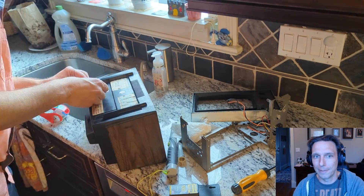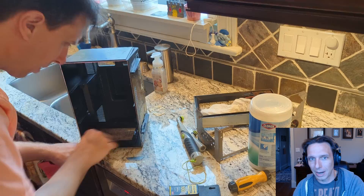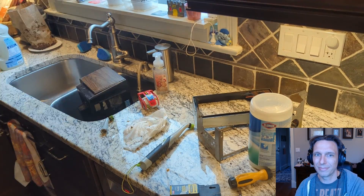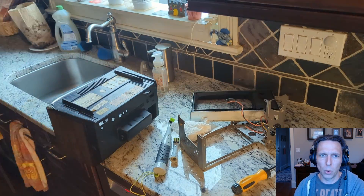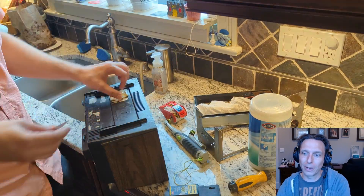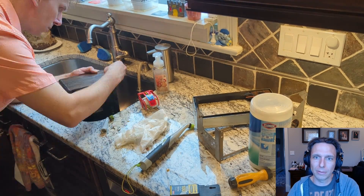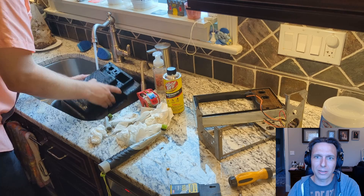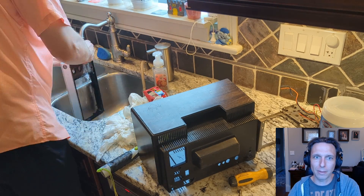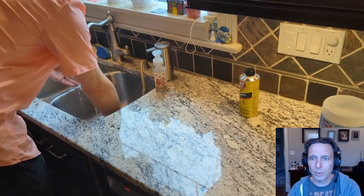Now it's bath day. I tried to get all these stickers off — I do okay. I ended up just covering them with packing tape and getting a razor underneath as best I could. Some came off, some not as much. Then that tape on the front I mentioned — that little bit of cellophane tape over the speaker grill — ended up being a problem. I tested the corners with Goof Off, which is a pretty strong solvent, and didn't notice any problems. But when I poured a little extra on it, it ripped the paint right off and I got a big bare spot on the front. I was really disappointed — I was hoping to keep it more original looking, but we can deal with it later.